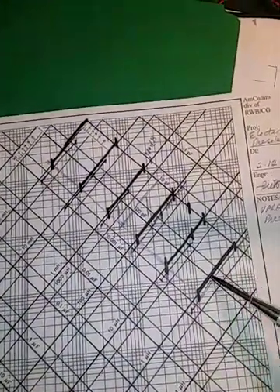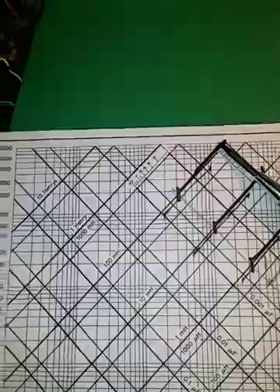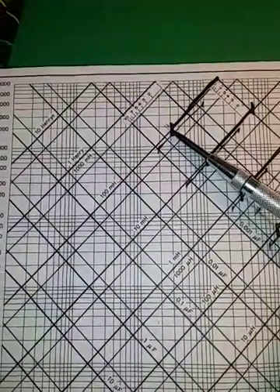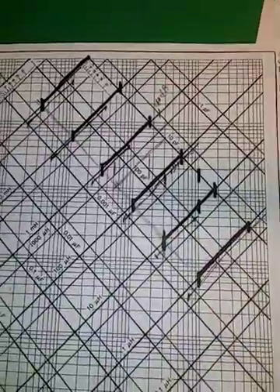Up at the high end — 100,000 ohms, 20,000 ohms at the low end of the low band — we're talking around 60 dB or better rejection. That's the theory.